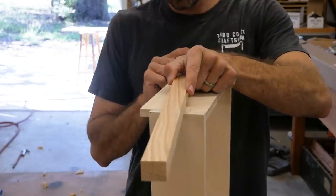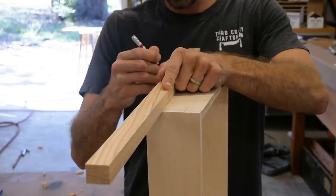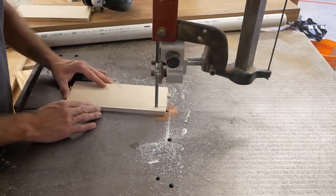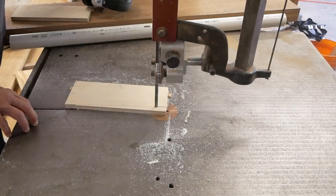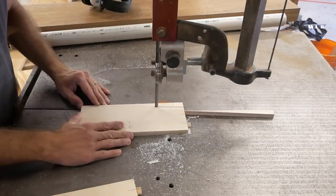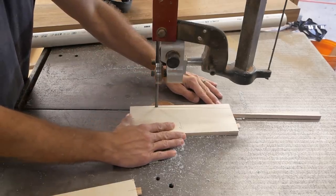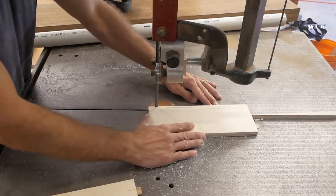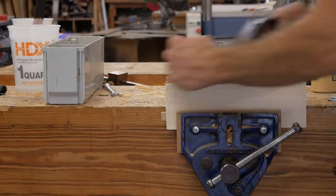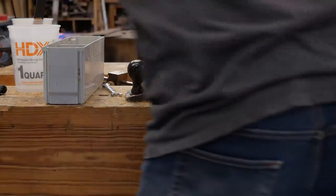Back at it. The box on the right actually sits next to an exterior hatch, so you access that from the outside. I need to build a shroud to close the gap from the edge of the box to the wall. I left a three-inch gap around the whole wall perimeter to the boxes — this allows me to run power, piping, anything I need between the wall and the bed. This little shroud has a bit of a taper to it that matches the taper of the wall, because the Airstream wall kind of curves and gets wider then smaller at the top.